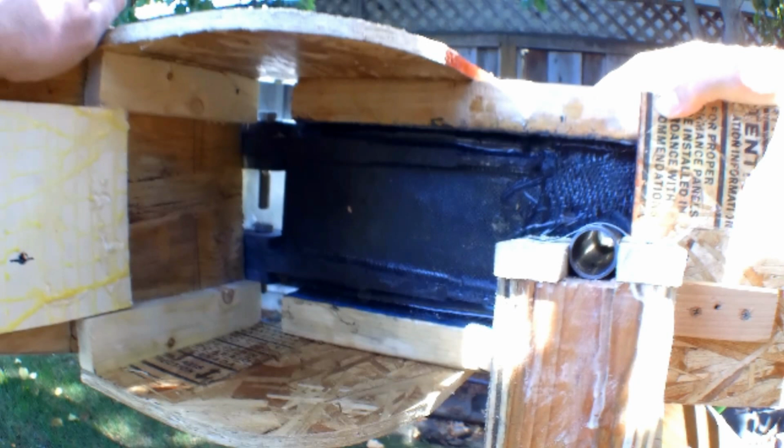So I'm going to have a follow-up test that is hopefully the final design of the wing attachment method. If that doesn't work, then I fall back to these large fittings that you see here. They'll actually add 3 or 4 pounds to the aircraft, but I know they will work. And if the final design works out okay, then we go that path and I save some weight. So in this one test, I'm getting several items taken care of. The wing itself, I know that the spar is plenty strong enough. It's been run through other tests, so this test is focusing just on the attachment fittings.